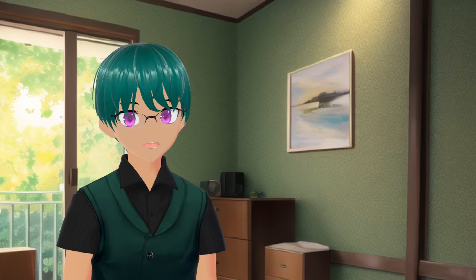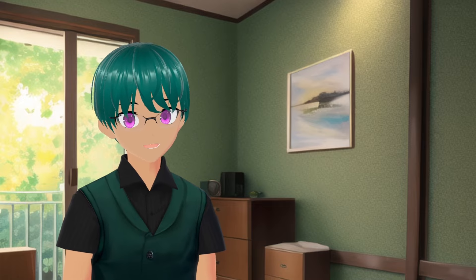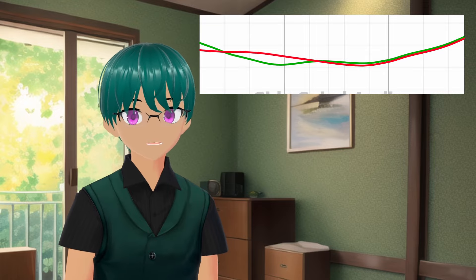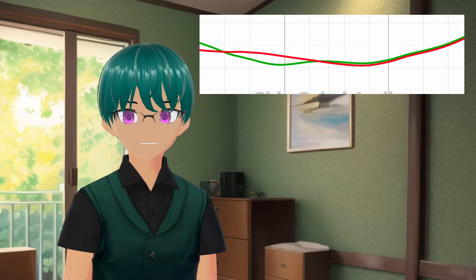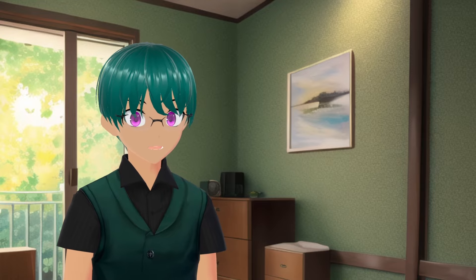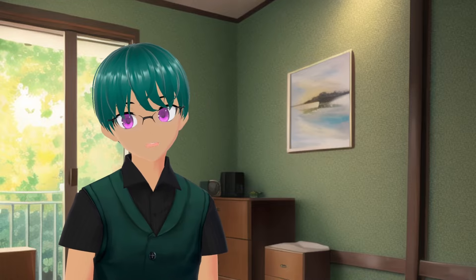There were some misunderstandings from the marketing that made some assume the IEM was using electrical filters rather than acoustic tuning, that the resonator didn't work, or claims that while it was attenuating 300Hz it was adding more energy to 500Hz as a trade-off. But from looking at this, we can see that it's more apparent that this is just the natural tuning of the IEM, and the resonator just didn't affect those frequencies very much. So when the resonator is working, it gives that sort of appearance. From this, I think it's safe to say that the resonator does work as advertised, and this opens up a lot of possibilities for IEMs in the future. I just don't think that this specific IEM is the best recommendation at this price point, and you're probably better off spending your money somewhere else.